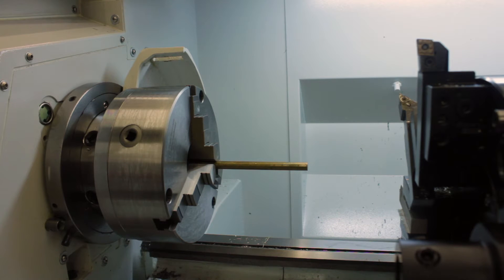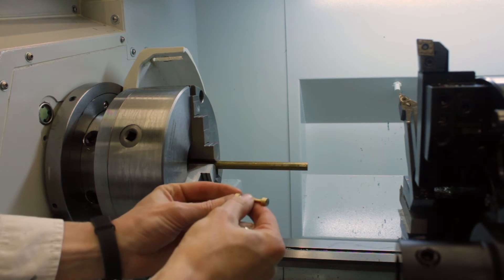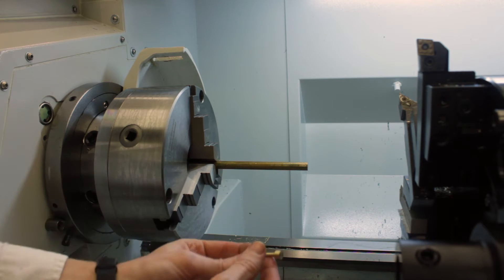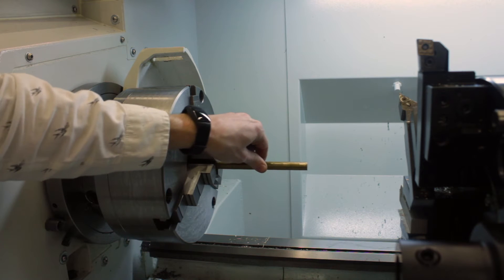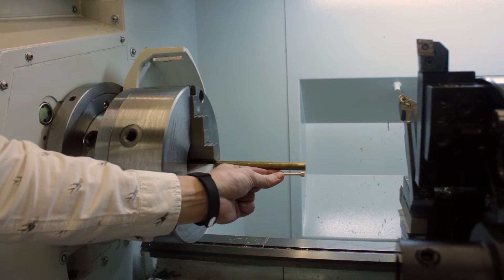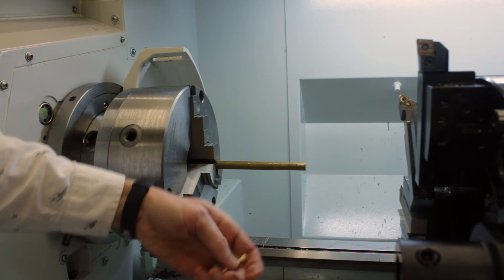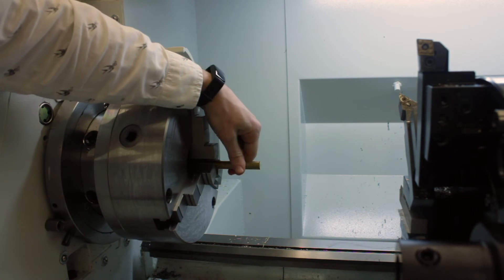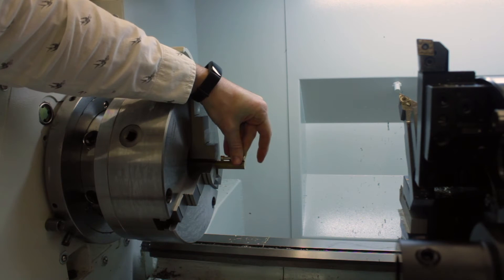This shows a less than ideal setup, and it was this kind of setup which produced a workpiece like this. Typically you'll see the taper going outwards towards the end, because as the tool cuts it deflects the workpiece backwards and doesn't actually put the same depth of cut on. A good rule of thumb is three times the diameter of the workpiece — this bar is about 12mm, so about 36mm sticking out of the chuck, which is conveniently enough the length of our piece.